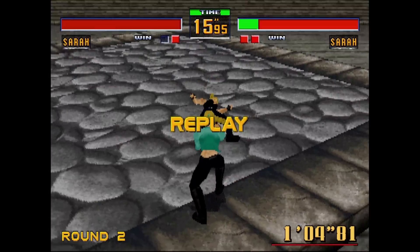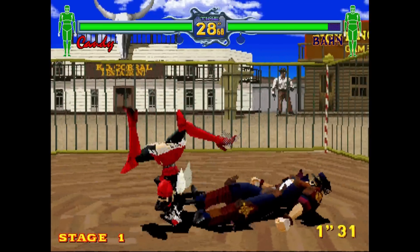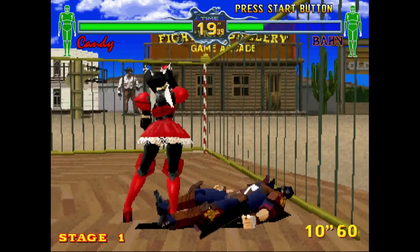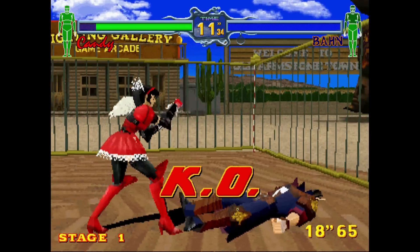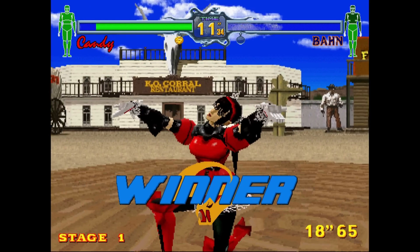It is night and day different and I can't get enough of this. It's probably the best that the Sega Saturn is ever going to look when it comes to interlaced content unless you're playing on an old school CRT TV, and that really is the reality. This video mode was designed to work with consumer television sets over a composite video signal back in the 90s. You'll see here on the fence in Fighting Vipers there can still be a tiny bit of shake — that's not a problem with the core, that's just what happens when you handle interlaced video even with something as good as the RetroTINK 4K. There's no such thing as perfect interlaced handling on an LCD TV or capture card. This was meant for consumer grade CRTs and that's where it'll always look best, but here it's like 99.8% of the way there.